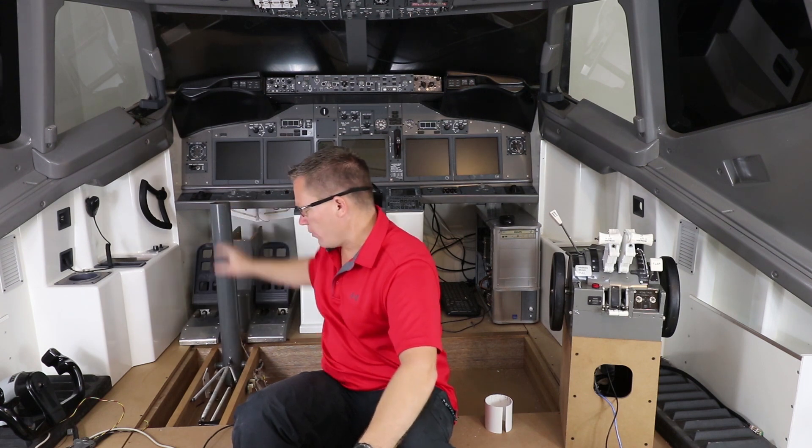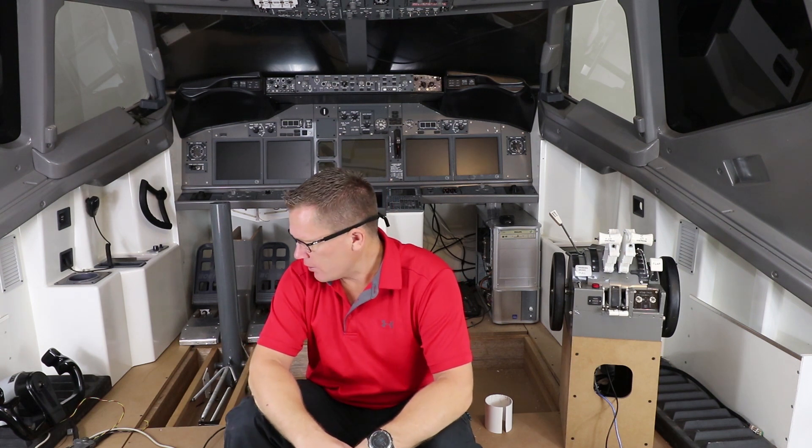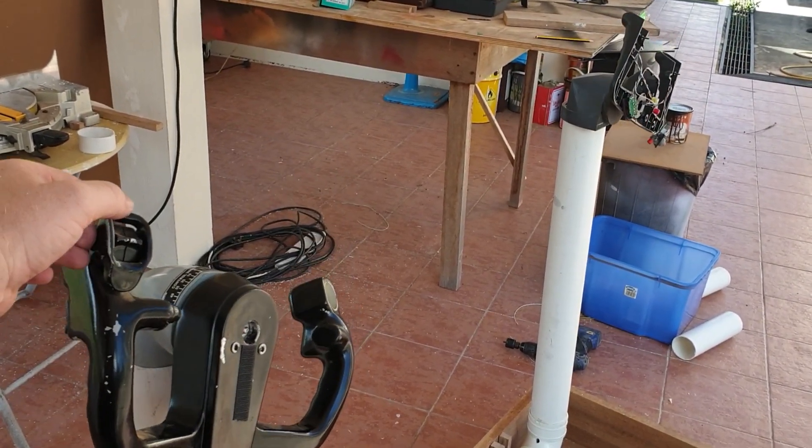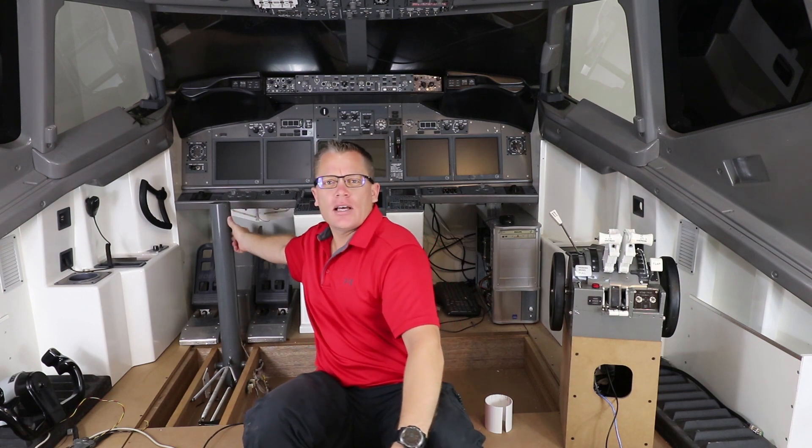On to my next big dilemma — the yoke and control columns. You've probably seen on social media: I created a dual-link control yoke basically from PVC drain pipe. That worked exceptionally well for the aileron control, but it completely failed in the pitch axis — you'd move one side and the other wouldn't move. The PVC pipe would just twist along its axis in torsion. It's out for the time being until I can get some aluminium tube, which will give a solid structure, and then we'll have dual yokes in the future.